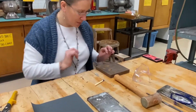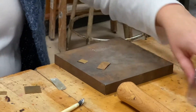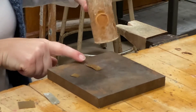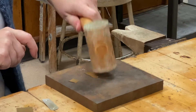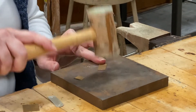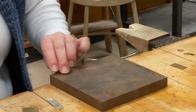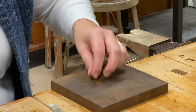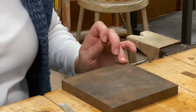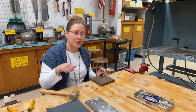Another thing you want to do is make sure that both pieces are completely flat. I can see that this first piece is totally flat, but this other piece is curved. You always want to hit on the high part of the metal to make sure it goes all the way down, being careful not to hit your fingers. I took a square steel block from over by the anvil table to do this.